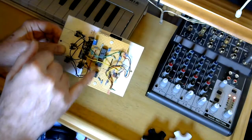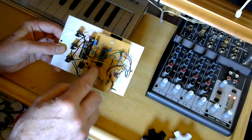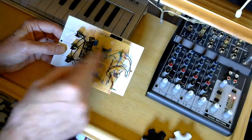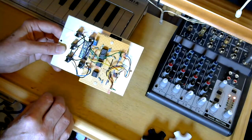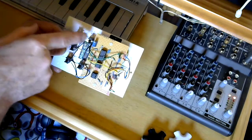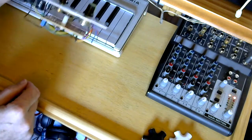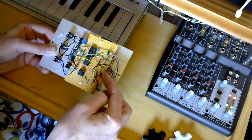The 2 chips down here are op-amp chips, and they're used for conditioning the voltage input that sets the pitch level, and also buffering the outputs from the 3 waveforms. We talked about these, obviously the sockets for pitch CV, modulation CV, and the various waveforms. The pots are, oops, put it out of the screen, the pots are on the back there. Power input there.